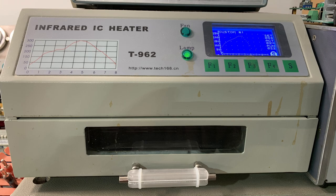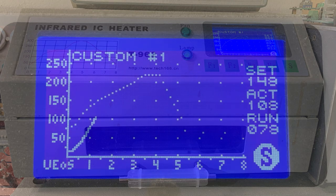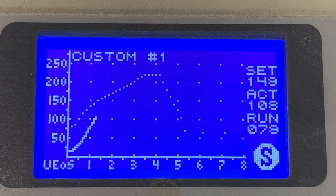For the first experiment I'm using my reflow oven — a T962 that's had a bunch of hacks done to it. The software has been replaced and some hardware replaced, so it's not the stock unit. Here's the software running: you enter a profile with minutes on the x-axis and temperature on the y-axis. It ramps up in temperature between zero and three minutes, holds that temperature from three to four minutes, and then ramps down from four to six minutes. You can get these profiles off manufacturer sites; this profile just works for my setup.